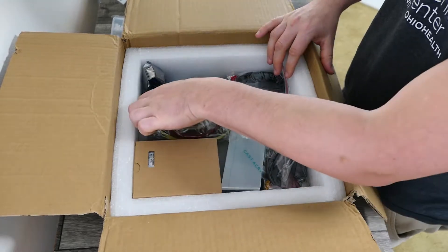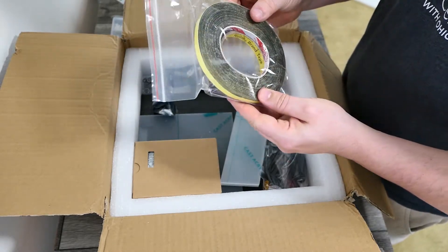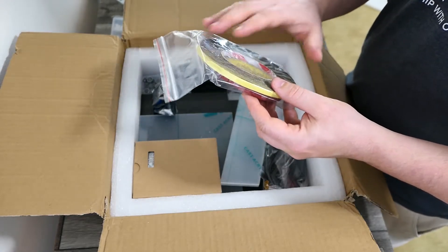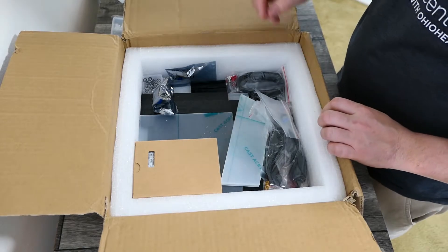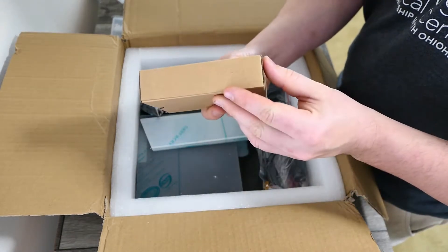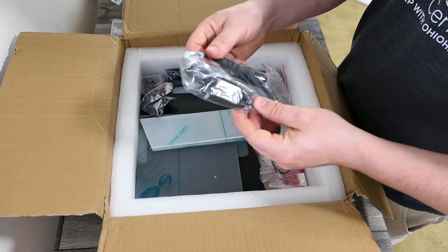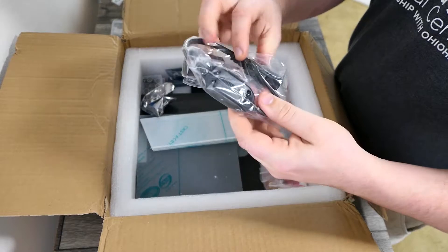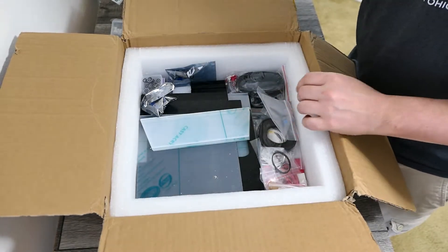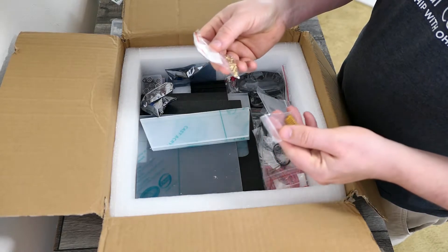We can see more of what's going on here. We have 3M double-sided tape and foam so we can seal parts together so they don't vibrate — making an airtight seal with the acrylic side panels. The power supply is an LRS-100, a very slim 100-watt 24-volt unit from Meanwell. There's also a power switch with AC power in and a switch in the middle so you don't have to consistently plug and unplug the cable. Then hot melt inserts, probably for the top hat and other things.